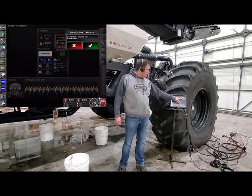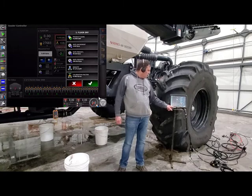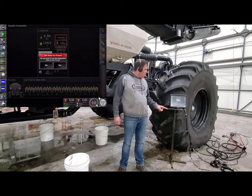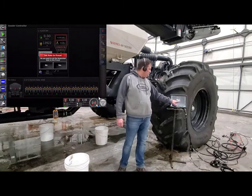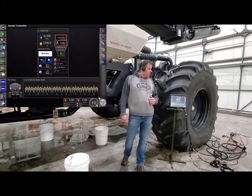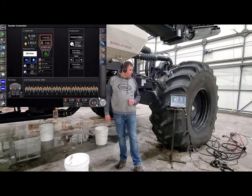Hit manual entry. It's in there and it has 0.2. Now what we can do is press OK. It'll ask you if you want to set your preset rate one as the requested rate. Press yes — it'll set it to 90 pounds. Now, we can get ready to calibrate. We want to touch on the gear and wrench, which brings out your configuration tab.